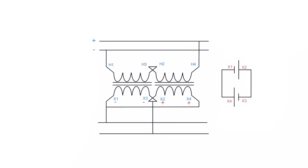It's like having this battery here where I've got the negative, positive, which connects to the negative, positive. So basically these guys are going to have a circulating current. There's very little resistance in this because all you're dealing with is the lead resistance, which means you're going to end up with, what do you want to guess? Kablazoflam again. So it is very important that you understand how to properly connect these.